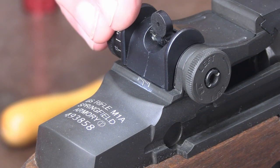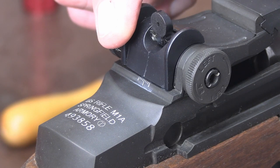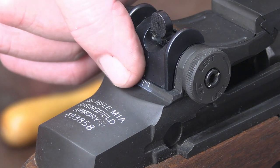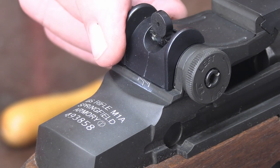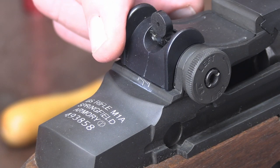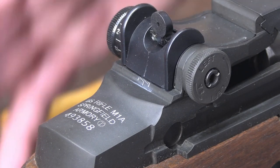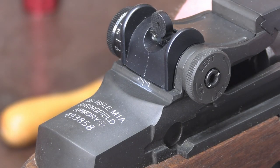You've moved it three inches — that also means you've moved it 30 thousandths of an inch. Each click represents 10 thousandths of an inch, 40 thousandths of an inch per graduation. Write that down so you don't forget it. I really prefer to do this precision work at a bench at home where I have a solid surface to work off of, a vice, good lighting, and I can use my micrometer without struggling at a range or out in the field.